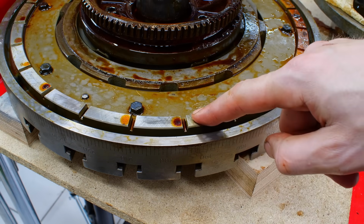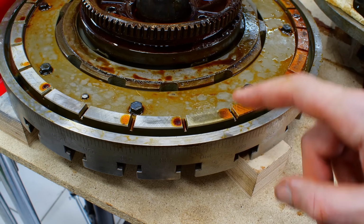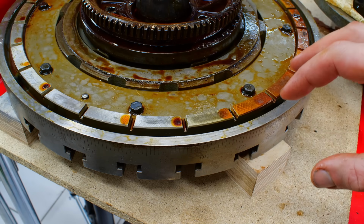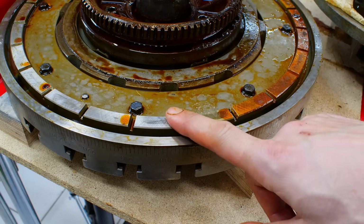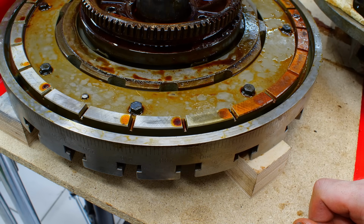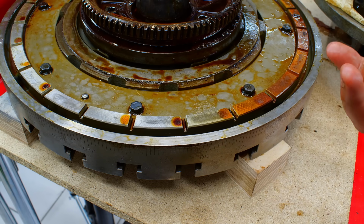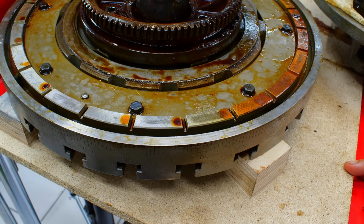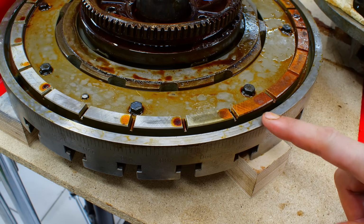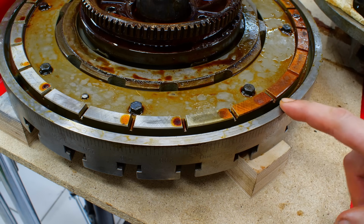And overall, I think this indexer is a more practical, general use rotary table, because it's more rugged and you have the direct indexing feature and the option to disengage the worm drive to free spin it, which you can't do on the Moore rotary table. Moore didn't do the disengaging worm on the high precision rotary tables for precision reasons. That's also the reason why it's plus minus 6 arc seconds compared to 90 arc seconds. But still, this is relatively precise for what I'm doing.